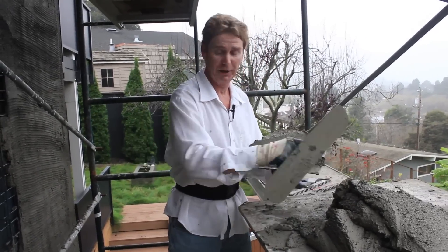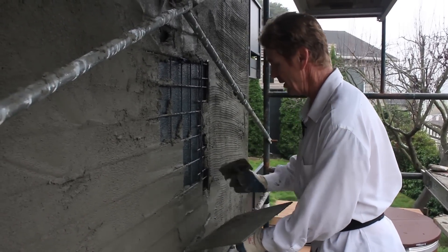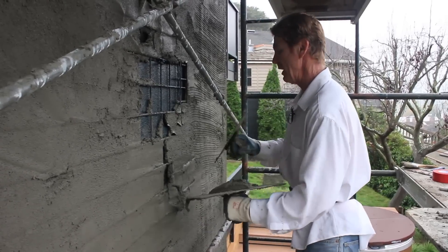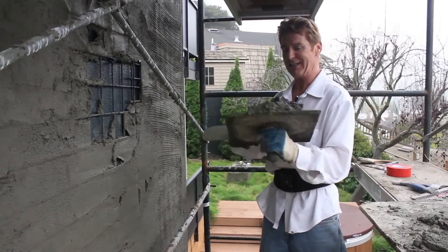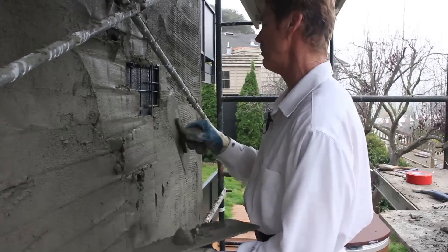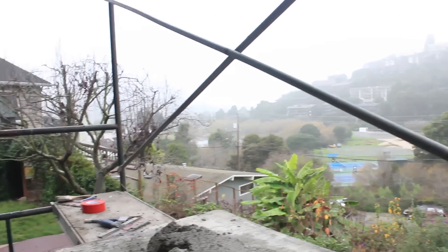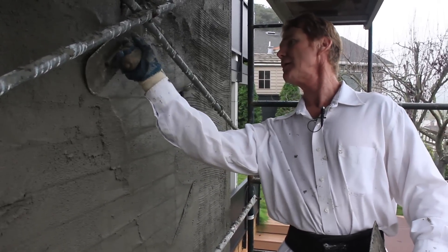We are hustling doing some weird stuff like this. What we do is adjust our mud, because first we found it was a little too soupy, so we stiffened it up with a little more cement to make the first fat coat go in there. Because what happens is it's falling out. These bars right here — someone suggested we remove them. But I said let's not remove the bars. Look how high up we are. I'd rather have the bars in the way and work around them than remove them, because once you take these bars off, it sure does get scary.